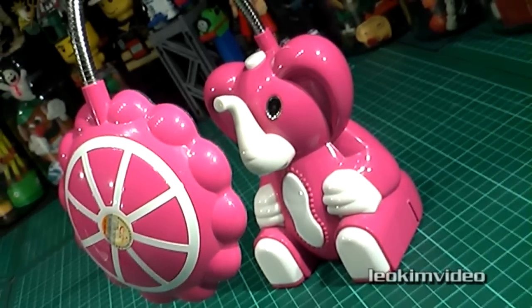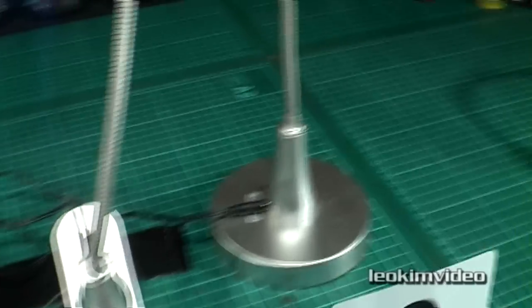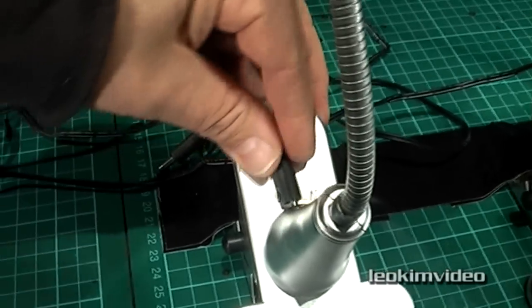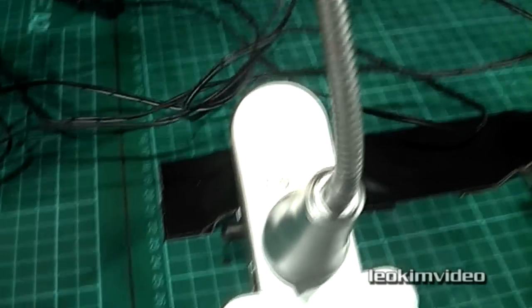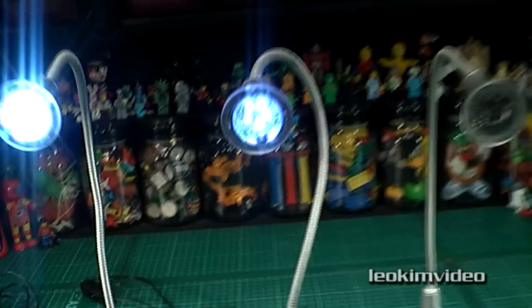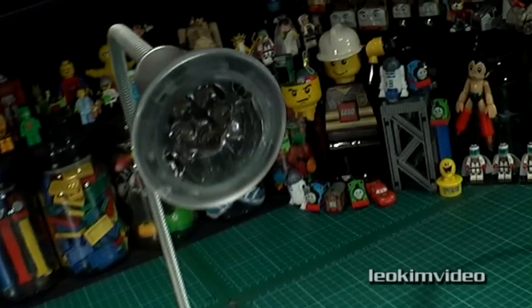These lights were purchased at Kmart Australia. I've got nothing against Kmart — I shop there a lot. But the logical thing to do would be to check the transformers. I'm taking the transformer from the light that works into the one with the strobing, and let's plug this one in. Doing a bit of a cross-check here — we can still see the strobing one is still strobing, and the good one, number one, is working correctly. So that tells me the problem is emanating from somewhere within the bulb set.